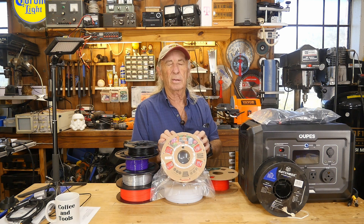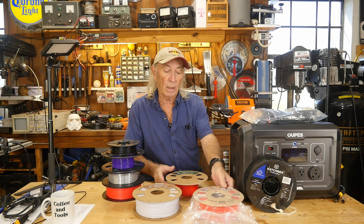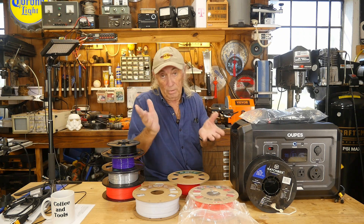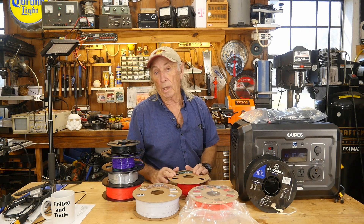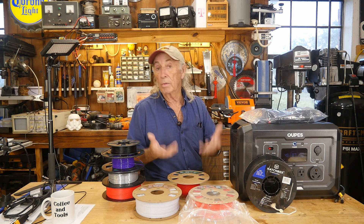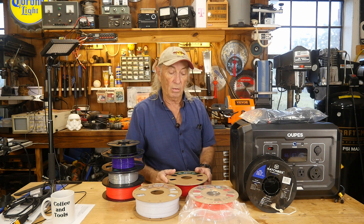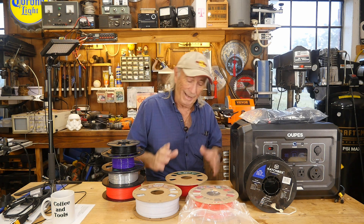The next question is: okay, you're a beginner, you've got your PLA — but there are some downsides. PLA does not like to be outside. It doesn't want to be in the sun at all. It likes a comfortable ambient temperature inside the house. In a workshop you're probably okay, but you have to be aware of heat, sunlight, and humidity. PLA is not good for those environments, and that's where you have to look into more exotic materials like PETG or even ABS.